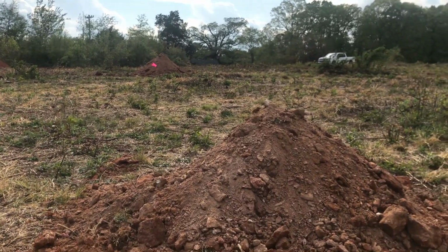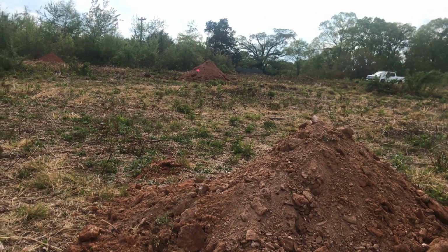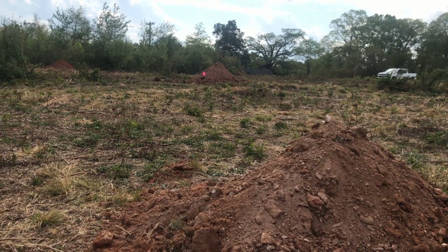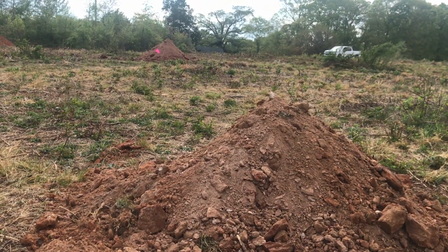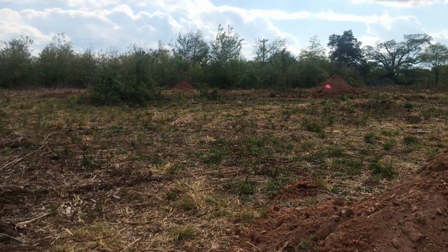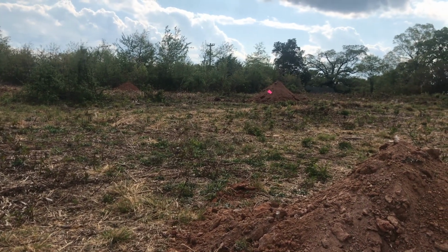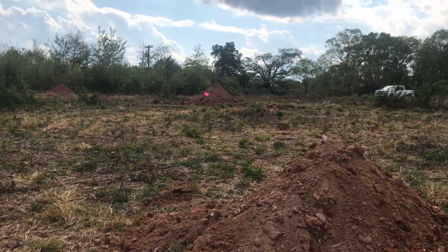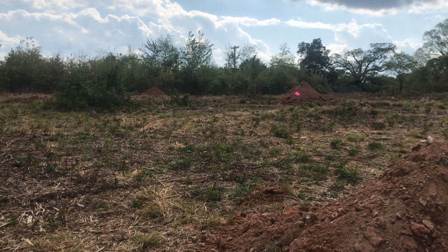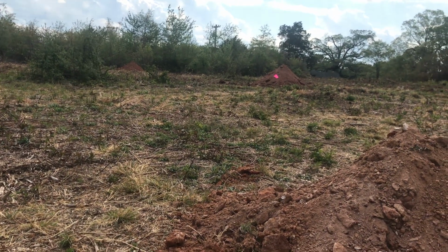The other factors that go along with that are bedrooms. We're doing a 3-bedroom home. Garbage disposal is the other kicker. That doesn't increase your drain field, but it does increase your septic tank by 500 gallons. And again, all these numbers are Alexander County. Your county may be different. But we're going to do a garbage disposal, so our septic tank has to be a 1,500 gallon tank, and with this conventional system we have to have basically 400 feet of drain line. So you have to have that, and then you have to have enough room for a backup system.